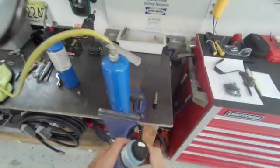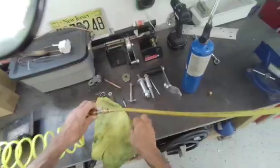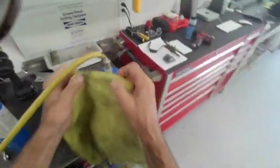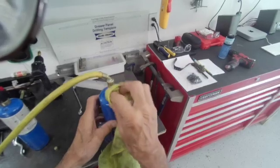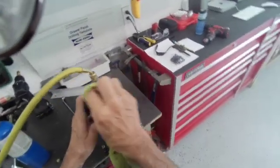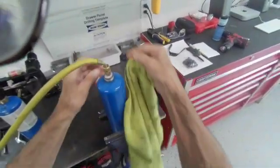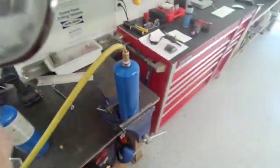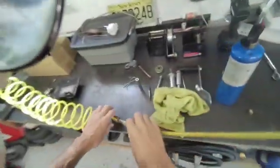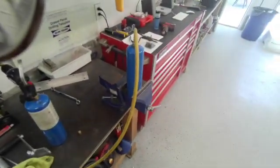That's how you build a two-pound Freon tank. If you're like me and drive around in a really small car and don't have room for big tanks, these things come in handy. Some of them I've painted different colors — I paint them white for Freon 12 and leave this bluish color for the 134A. Those are the two refrigerants that I use all the time. That concludes this project — see you next time.